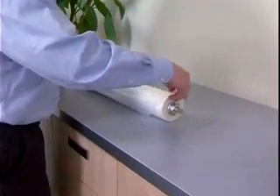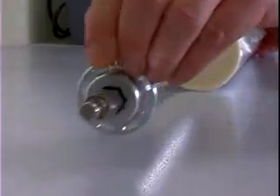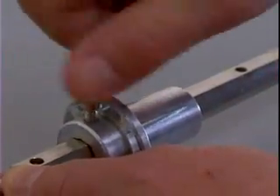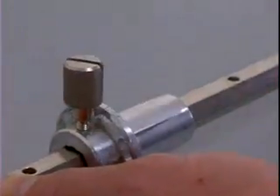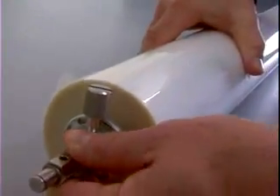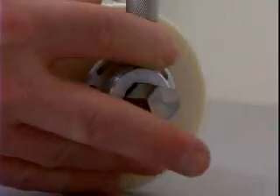Remove the bottom film roll by releasing the right core chuck. Remove it from the shaft and slide off the existing roll. Check to see that the left core chuck is screwed into the correct pre-drilled hole for your film width. Place the new film on the shaft with the glossy side out and the film unrolling from the bottom toward the back. Slide on the right core chuck and tighten the chuck.